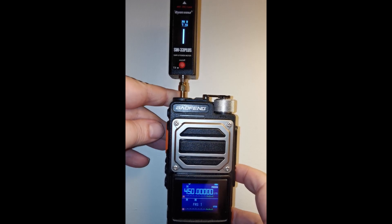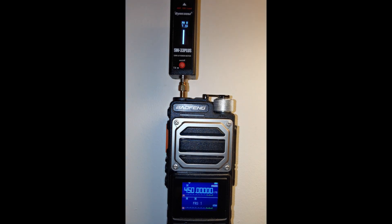So yeah, they all seem reasonably consistent. It's good to see that it's actually meeting the advertised output power — the advertised output power on this one is 10W, and it does appear to be doing that on VHF. On UHF it's just under 7.5W, and as usual with all of them, the 220 band is down at the 3 to 4W range. Anyway, this is just a quick test of the power out on the UV25L. I hope you liked it — like and subscribe.